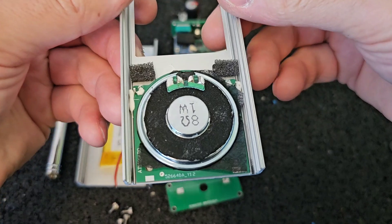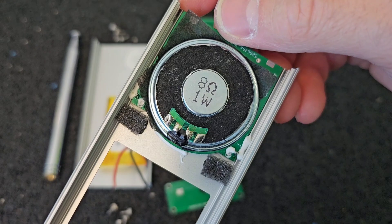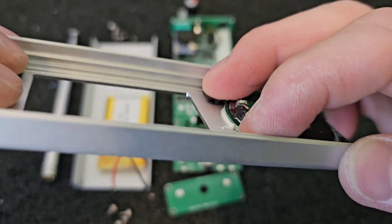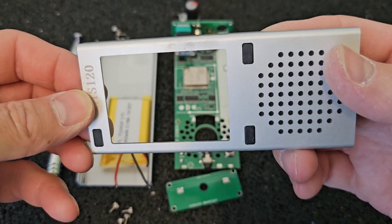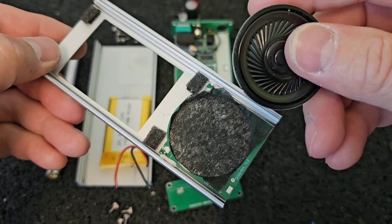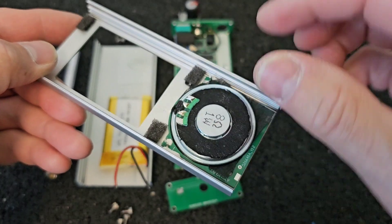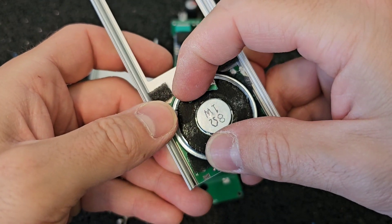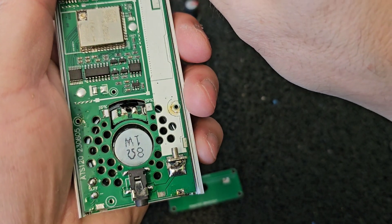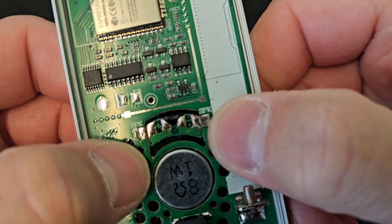On the front panel we can find the speaker, which is an 8 ohm 1 watt speaker. There are also 3 tiny hard buttons with a small piece of sponge on the back of them which is glued. The small speaker's membrane is made of plastic — the same membrane used in Chinese VHF and UHF radios. There are no wires between the speaker and the main board; they're just soldering pads.